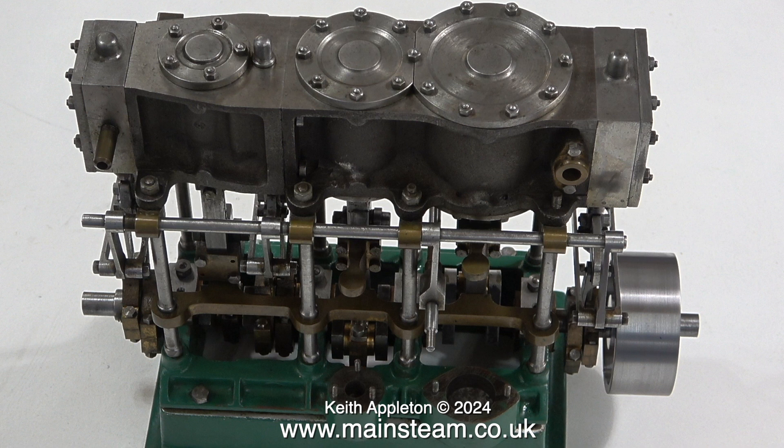This image shows the engine as I received it, in quite good mechanical condition. Have you noticed the cylinder isn't shaped properly on the left-hand side at the top? I can also see there aren't any gaskets fitted anywhere on the engine, and I think there's a sheared stud on the low-pressure steam chest cover. I also noticed some very tiny blow holes in both of the steam chest cover castings.